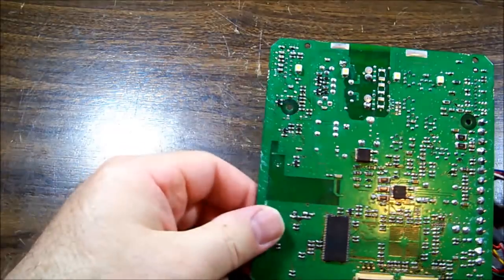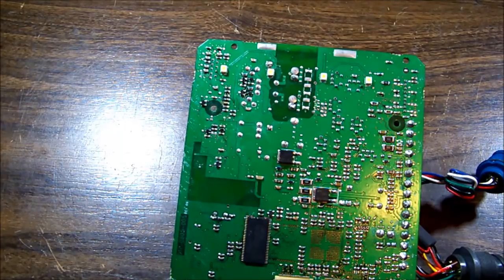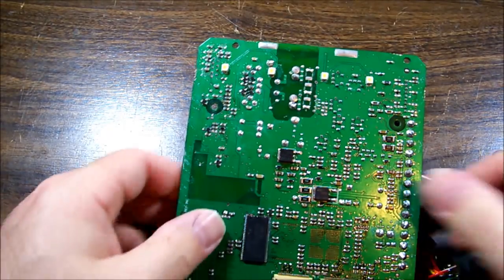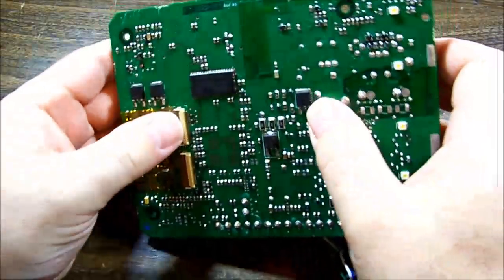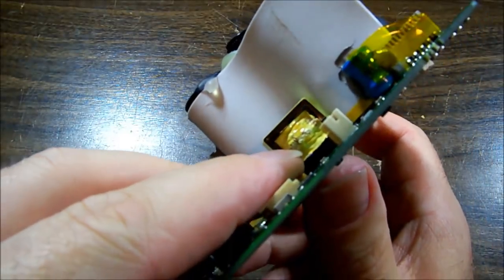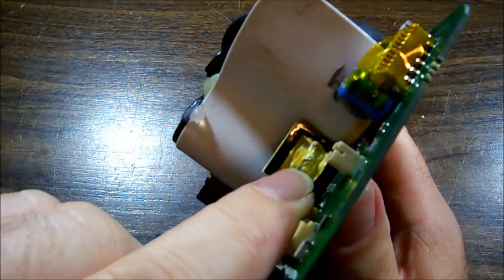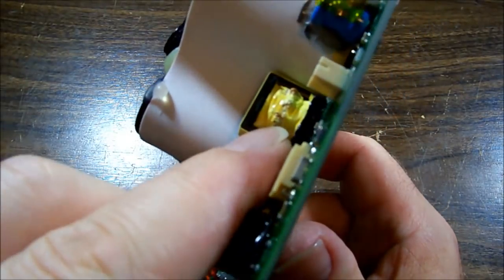I'm going to take it off the board, check it again out of circuit, find a data sheet, find out what it is, and hopefully, it's interesting though, being shorted through, I wonder what that's actually doing. It doesn't look like it's doing any switching, but we can never tell. And this right here I've noticed, look at that, look at all the bubbled up on the insulation there. So I wonder instead of switching across this, it's just been sitting there shorted and getting stinking hot, eh?